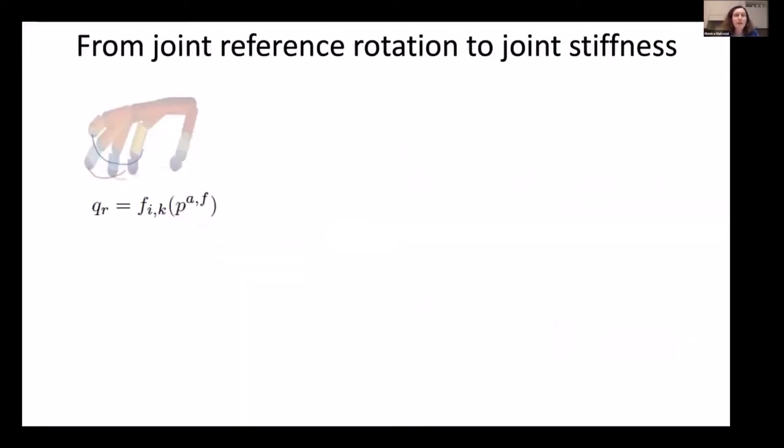Of course, we cannot get any motion like we did with the fully actuated one. So we have to choose one possible motion. Since we intend to use this type of device for grasping tasks, we choose the first postural synergy as a paradigmatic motion. So the mapping procedure that I introduced before was applied not to any motion of the hand, but only to the first synergy.